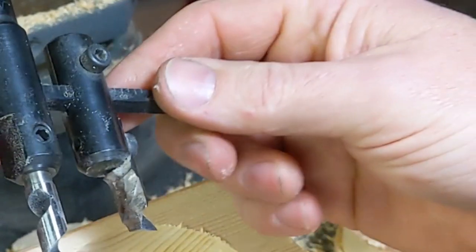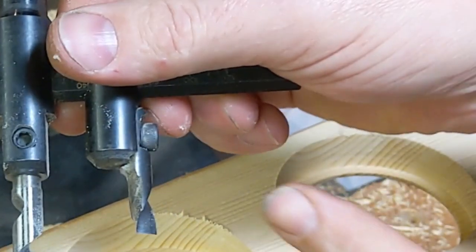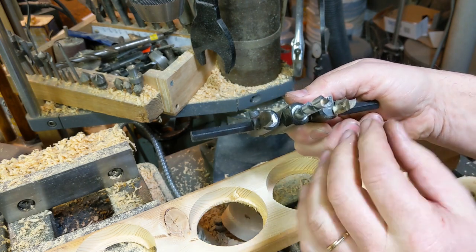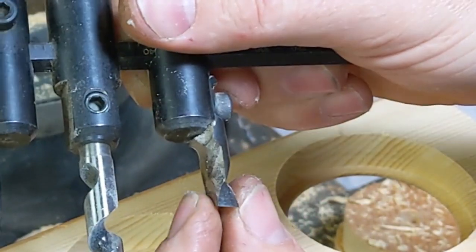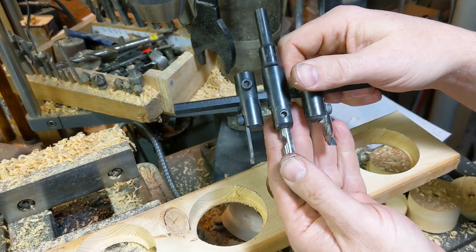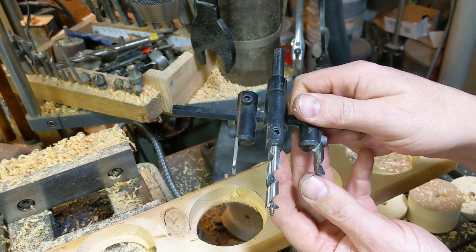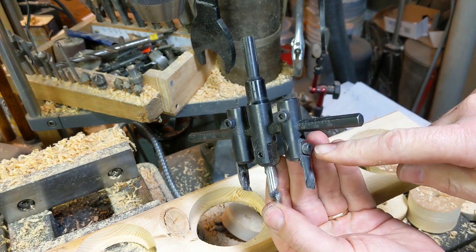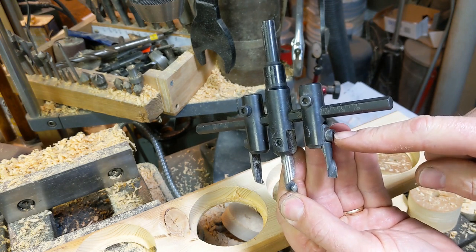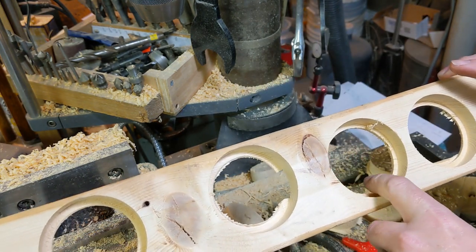For the outer cutter — the one that cuts the clean outer rim of the final hole — I took a high-speed steel drill bit and modified it so it can bolt onto the shank. I made sure it was clocked such that I have a nice sharp corner in line with the center of the drilling. This now has a three-sixteenths to nearly quarter-inch curve that leaves a nice clean flat bottom for the outside cut. Being high-speed steel, I didn't have to be too careful about overheating. It was a real pain to drill through — I used a carbide masonry bit sharpened to a sharp point, with a lot of pressure, to drill through the high-speed steel.